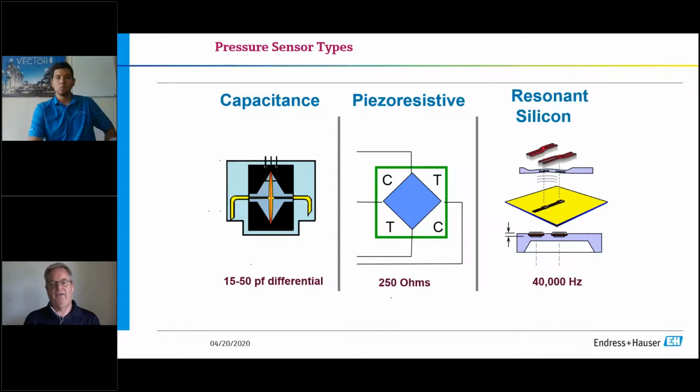So as I apply that 300 PSI to both sides, because in the U-tube manometer, liquid seeks its own level. So if I'm in an equal format and there's no differential across it, the plate will see the same pressure. But every now and then over time, when it shifts, it can move a little bit. And that could be differential over time of the static pressure from the P1 to P2.